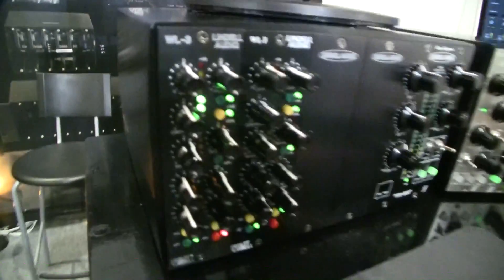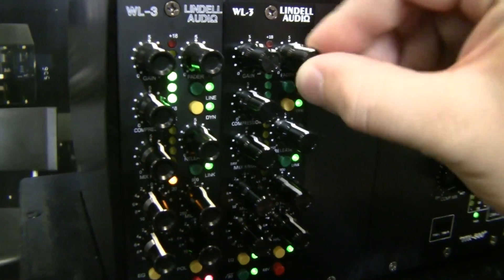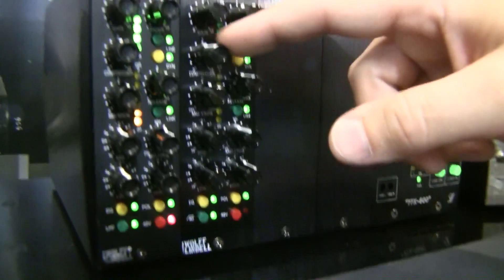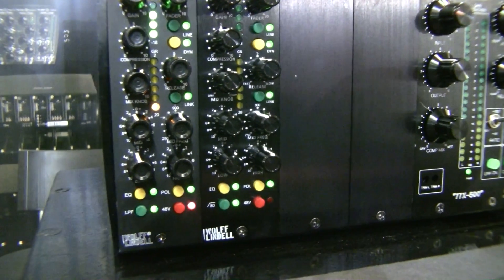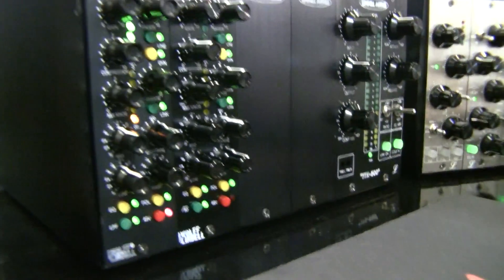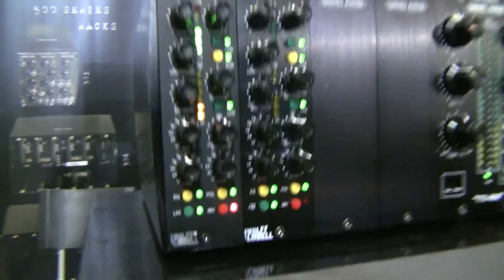It's quite a feat of miniaturization. You get a proper mic amp and a proper console output stage, so you can really drive the unit and use the output as a proper fader, like you would on a console. The compressor is a VCA-style with a wet/dry blend. There are jumpers on the board inside where you can set the speed and behavior of the compressor — from smooth to aggressive — and you can link it with a second unit. The EQ has low and high bands and filters, with a sweepable mid ranging from 500 Hz to 5k.